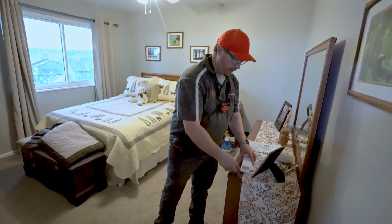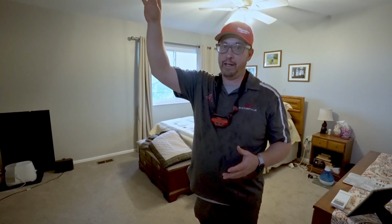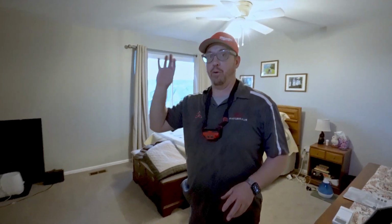Do keep in mind, these are machines built for room-to-room applications. You're not gonna be able to put one in and cool your whole upper floor. It just doesn't work that way. You're gonna wanna put one in every room that you want conditioning in. That's a really neat thing about mini splits or ductless technology: you can zone everything and not run the ones you don't need. If you're not going to be in there, why run them?